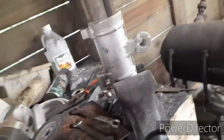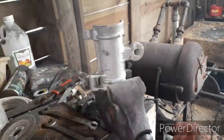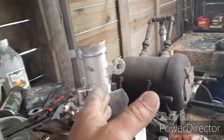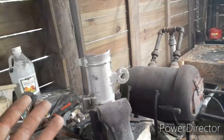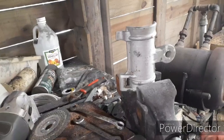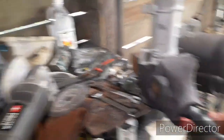I'm going to get these into a place where they will fit into the crucible, so I've got to cut these little ears off. But cutting aluminum is not always the easiest thing. You have to use an aluminum oxide bit for the most part, or a diamond tip bit. The reason it's so hard to cut aluminum is that aluminum oxidizes with heat really well, so when you start cutting the surface of it, it turns into aluminum oxide, which is an 8 or a 9 on the hardness scale. So use a cutoff wheel — works best.